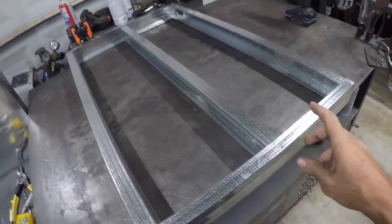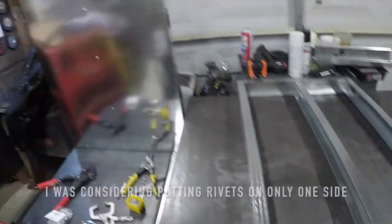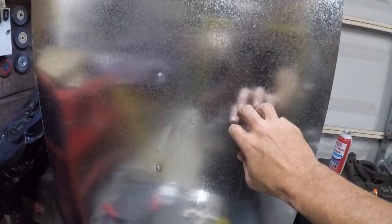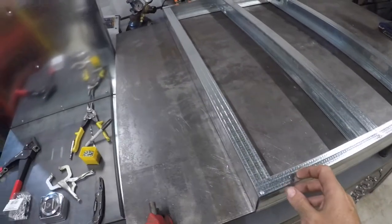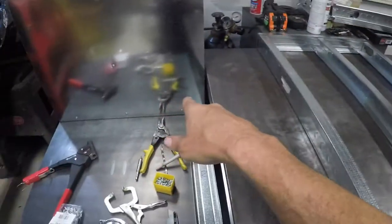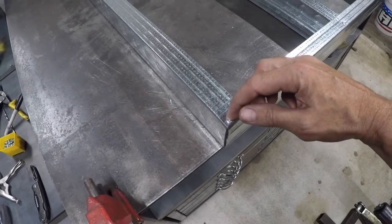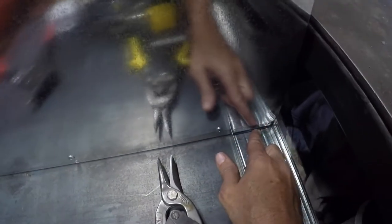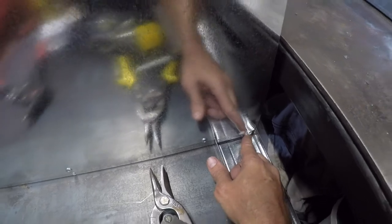Here's one of the sidewalls. I did end up putting rivets on both sides because when I did the back walls, all finished, I put some 26-gauge galvanized steel that you get at Home Depot — it's about 12 bucks a sheet. I did put it on both sides. I just kept the rivets really low and then I cut the sheet a little bit short so there wouldn't be an overlap. There's only one on the top and the bottom.